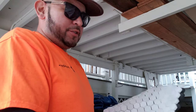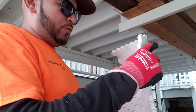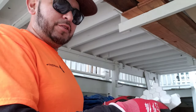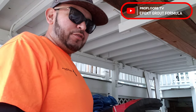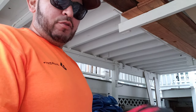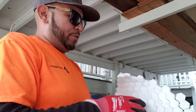We are going to do a six-side seal. In other words, we are going to fully immerse, fully cover with sealer. We dip these sheets of marble in sealer for 15 seconds each, then pull out, set on the floor, and dry the surface. We are drying off any excess sealer over the surface. Let that dry on its own — we are only worrying about wiping off the surface so that everything else can absorb properly.